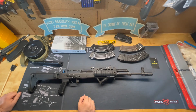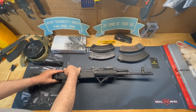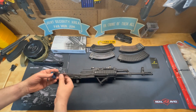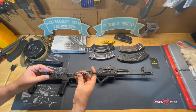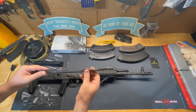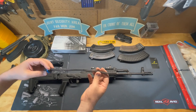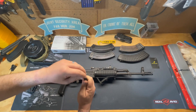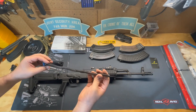Putting this little piece of rubber in there stops metal-to-metal contact and makes shooting much more comfortable. To remove the recoil spring, push this spring guide forward, lift it up and the recoil spring comes right out. It's a two-part assembly with a rod and two small oval-shaped loop springs, captured by the extension lips. You can take it apart to install this buffer or change to a different coil spring.